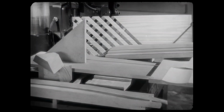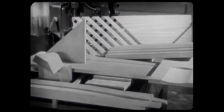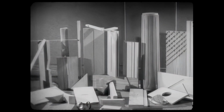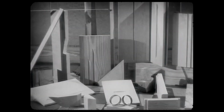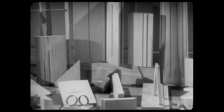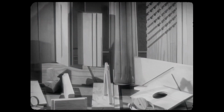The 6 saw cuts, the 6 dado cuts, and the 3 shaper cuts total 15 different setups. The DeWalt is the only machine that can give you a sample cut of each of these 15 cuts within 15 minutes, including all changes of tools and positions. Compare this average time of 1 minute with your present average time, and you will understand why we say that a DeWalt will pay handsome dividends on setup time alone. The DeWalt will equal and frequently exceed the performance of any of the individual purpose manually operated machines required to duplicate any one of these operations.